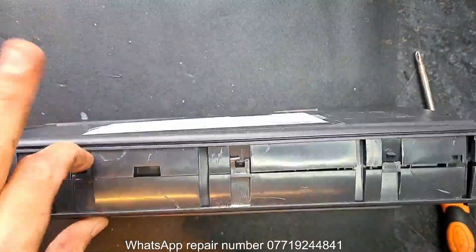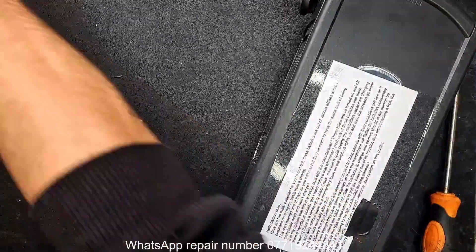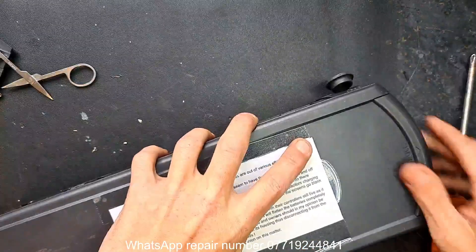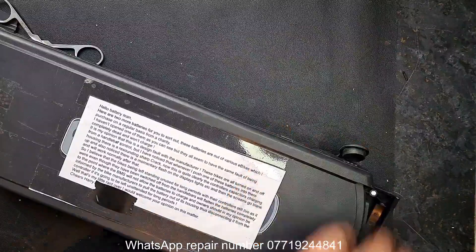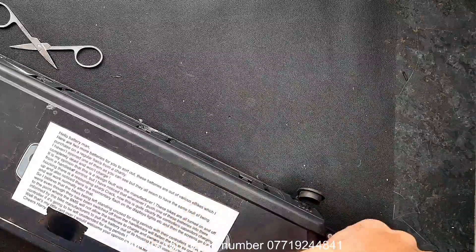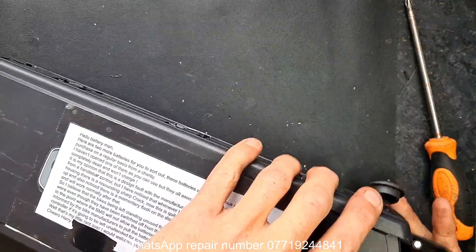A little bit easier just to put your fingers under and even them up. Let's have a look inside. It seems to be one more screw holding it together — and we have two more screws just under the handle. We'll pop these two out. Now this has the appearance of having a smart BMS — I'm quite excited to see if it's just a facade and they're really overcharging for the battery, or if it does have a smart BMS like the Bosch, Carrera, Giant Trance. We won't know until we get it open.